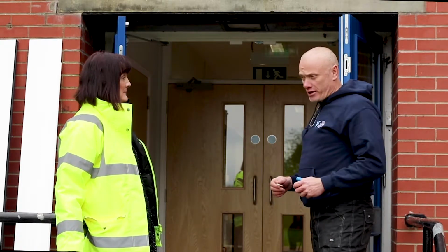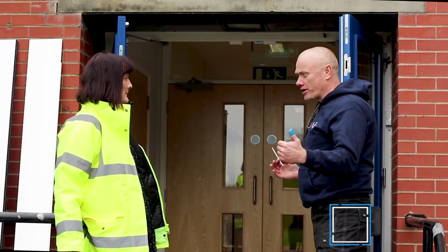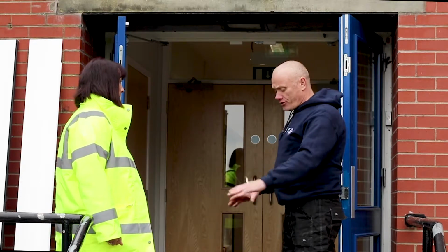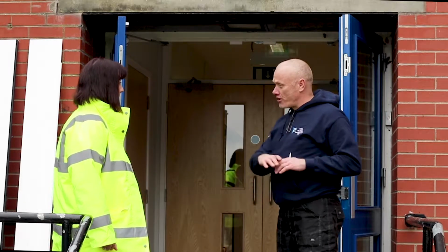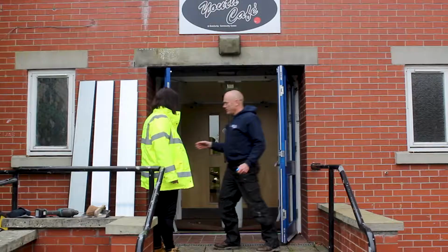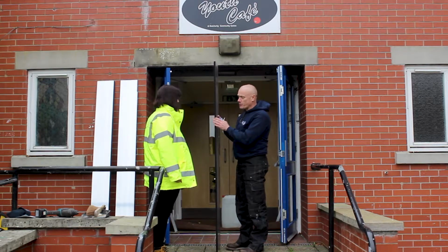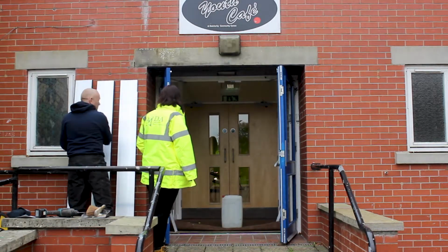Well, obviously the surveyor comes around and finds out what barrier is needed to do the job, to make sure that the barrier works. They take into consideration if it's inside, whether the doors are solid, if they're vertical, and if the ground is flat, because if it's not, we can channel out to put a ground rail in, and then cement it back in to make sure that the surface is flat. So when the actual board goes in afterwards, we get a good seal, because ultimately it's a seal so we can stop the water pressing into the concrete. So that's what we ensure.